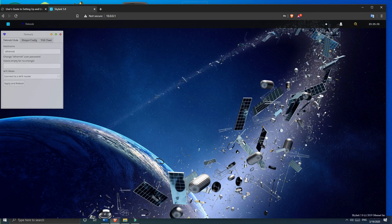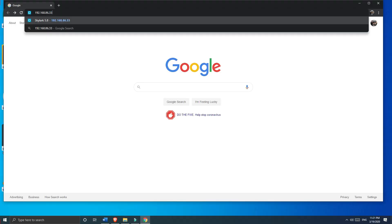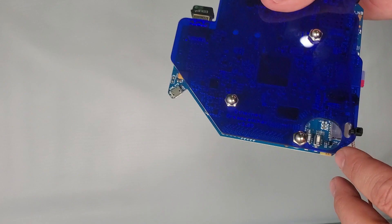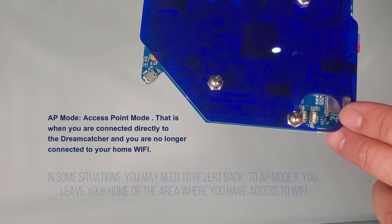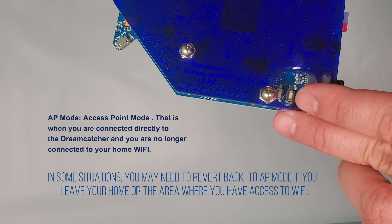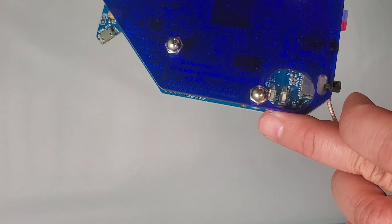Allow the system to reboot, then log into your home wireless router and locate the IP address associated with OtherNet. Then open your web browser and enter the IP address assigned to your DreamCatcher board. Now you can log in from any device in your home by typing the assigned IP address in your web browser. To switch back to AP mode, all you have to do is press and release the PB1 button on your DreamCatcher board, which is located next to the power button. To reset the network settings to default, press PB1 twice in less than 7 seconds. To clear everything including your downloaded data, press PB1 three times in less than 7 seconds — this last step is basically a complete factory reset.